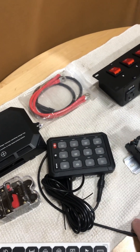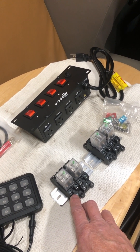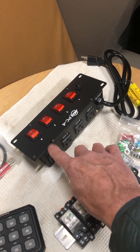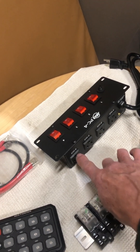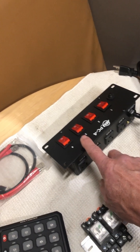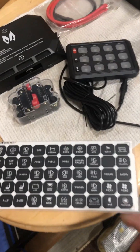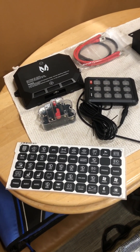So for the AC switched things, we're going to use these — 12-volt DC coils to contacts that'll handle 240 volts, which we don't need; we need 120 volts. So this will toggle these relays on and off, and then these will be wired into this. We've got four outlets because I don't want to cut the plugs off my AC unit, Starlink, and my NVR for the security system. We're going to pull this plate off the top four screws and bypass these four toggle switches, and those will control these outlets. These are cool little stickers that you stick on here that backlight.